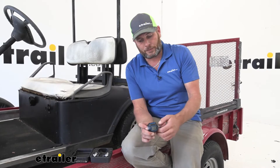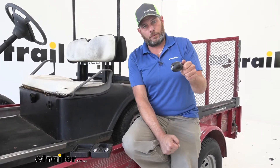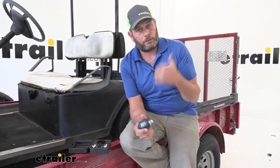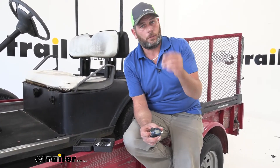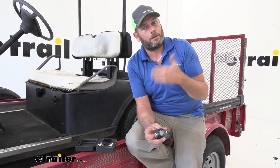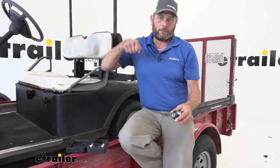This is an excellent idea and a very easy to use system. The screen will rotate for you, so regardless of whether you've got it in a downward position trying to tighten it or it's a little bit higher, you'll still be able to see the readout. When we use it here in a few minutes, it gives us different beeps. Once we get up to 70% torque, it's going to beep. At 90% torque, it's going to beep a little bit quicker. And when we get to 100%, it goes to a solid beep, giving us an idea of how close we are and how much further we have to go.